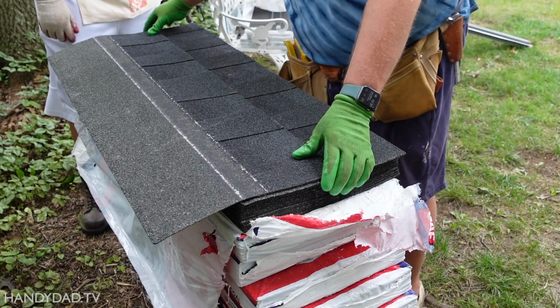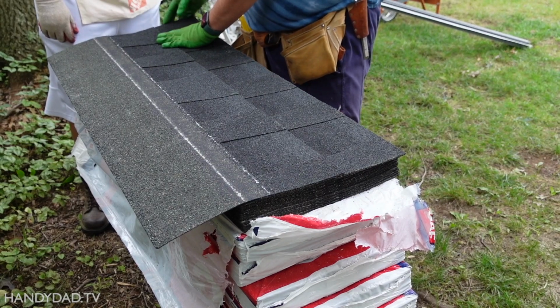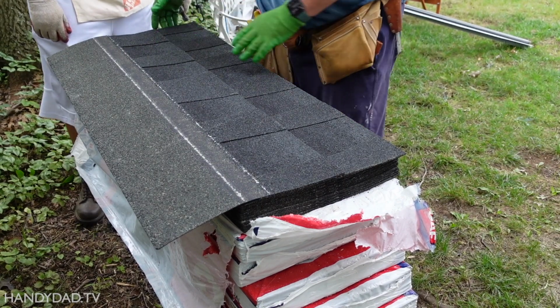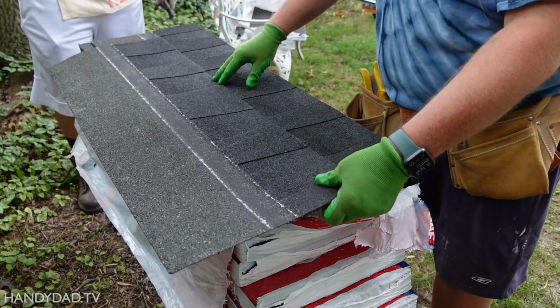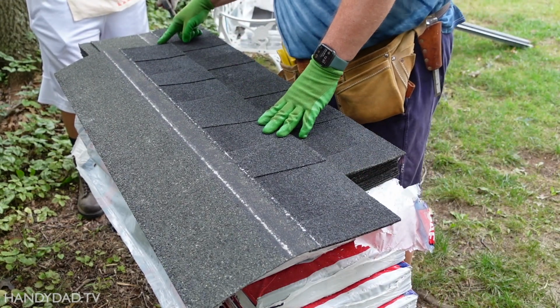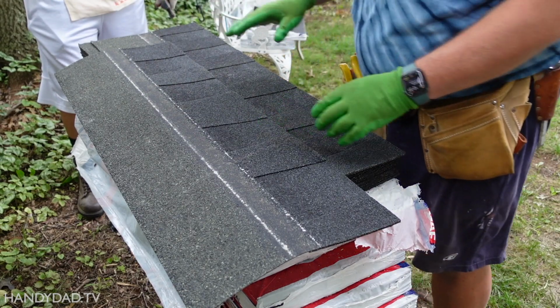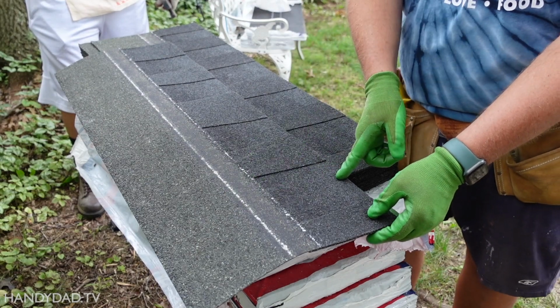The trouble is, you can't have your seams in line, okay? Otherwise, water will go through. So what we need to do is offset them. And when you offset them, that puts your seam here, and you can put another full sheet that way. Right? Seams don't overlap. You're good. But that means this part here is scrap.